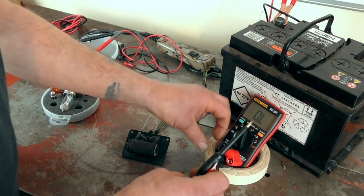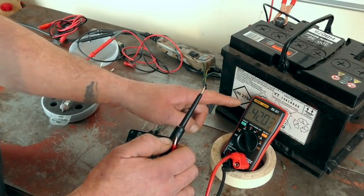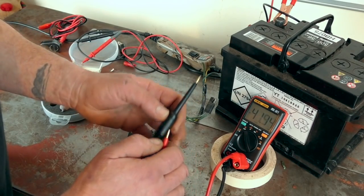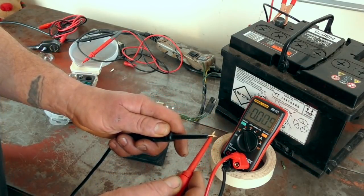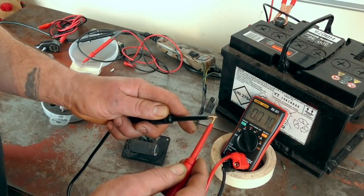The buzzer doesn't have brilliant uses — I don't use it much. Let's go down to millivolts. Now you can see the screen here — this is another utilisation I really like. When you move your leads about you get ghost voltage, but when you actually make a proper circuit contact you'll get something solid that should really go down to zero.